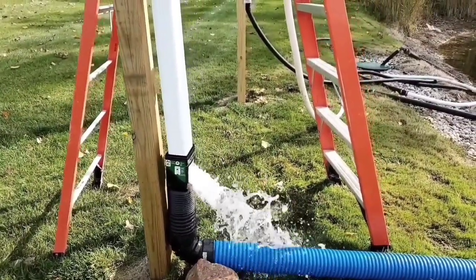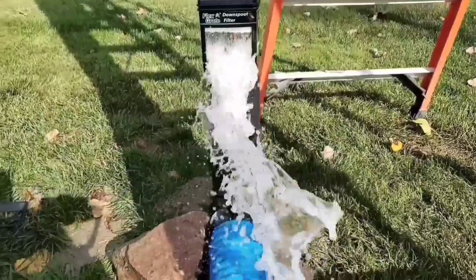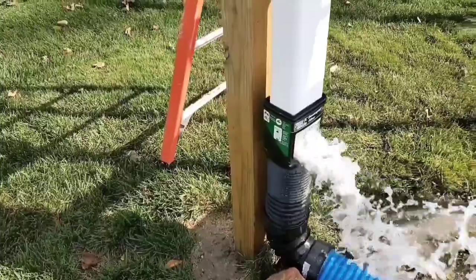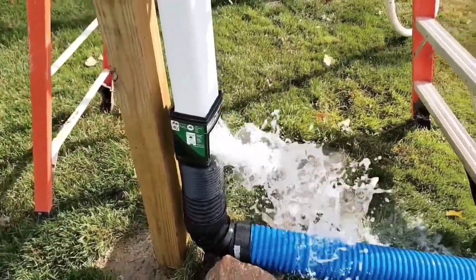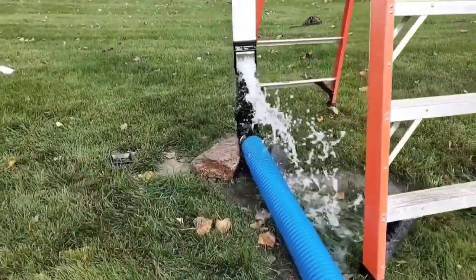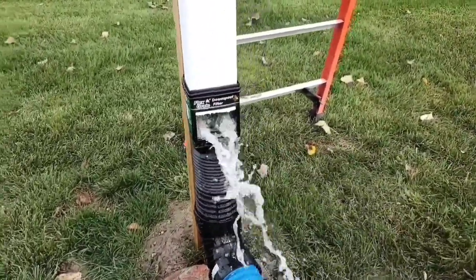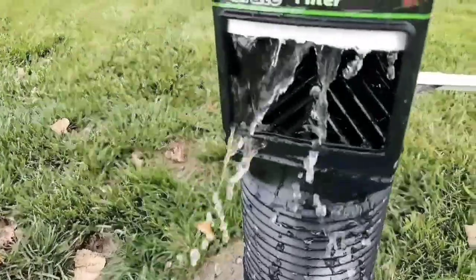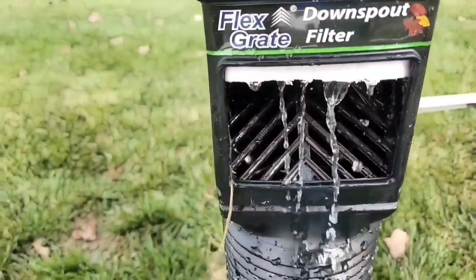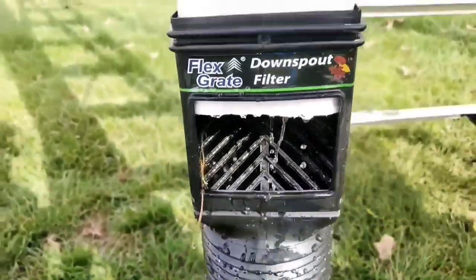This is my opinion based on what I can tell as a contractor. If you have a hard rain flowing any kind of water, it's not going to flow through — not during a decent rain. If it's a light misting rain with just a little bit of water trickling down the downspout, maybe it goes through. But we ran all of these clean-outs and all of these leaf filters with the same amount of water, doing a stage one and then a stage two. It doesn't matter how light the water is falling through the downspout — you're not catching it. There's such a liability whenever you let water go and then hope you're going to regather it.